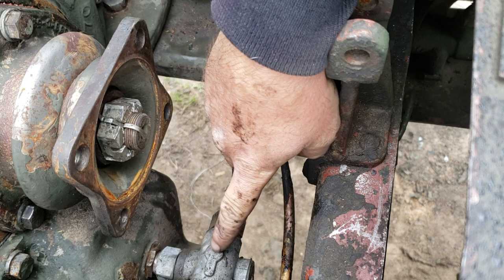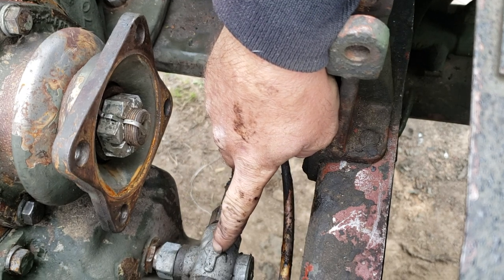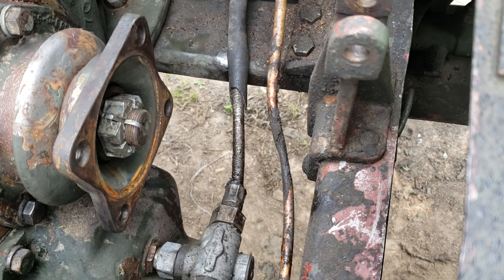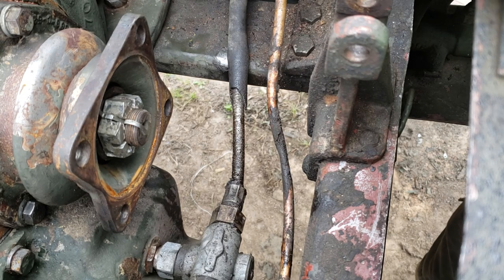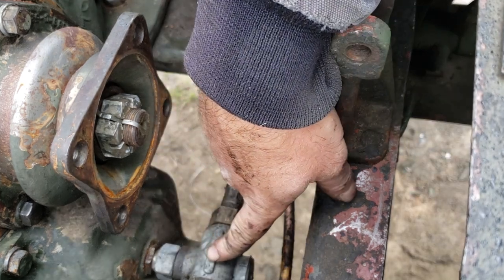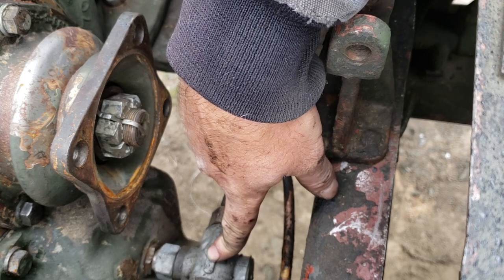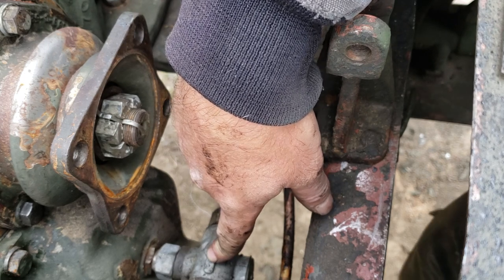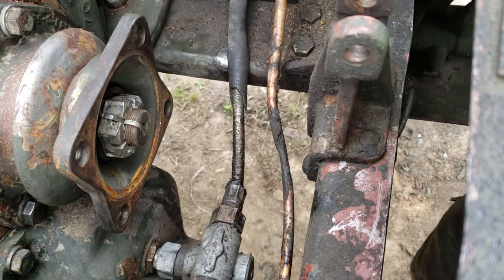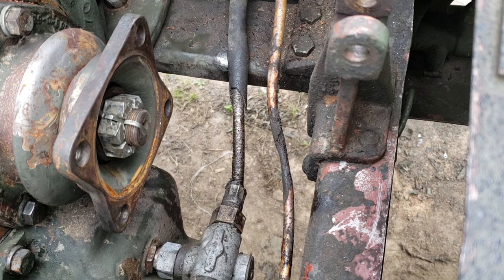This is your transfer case speedometer adapter. This is the thing that, if you're running a taller tire than normal, say you're running 1120s up to 395s, any of those sizes, anything above a 920, your speedometer's gonna be off. You change this to a 0.222 ratio, and it puts your speedometer back in a range where it's actually somewhat reliable. Big Mike's also has those. I don't know what they cost, but yeah. Anyway, that's not the point.